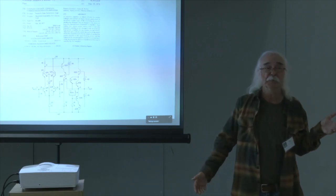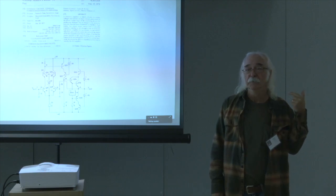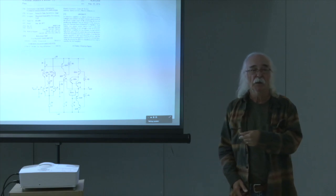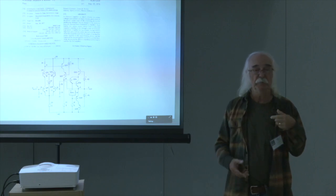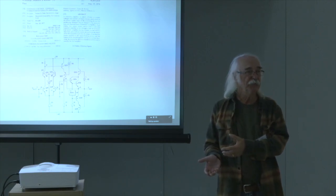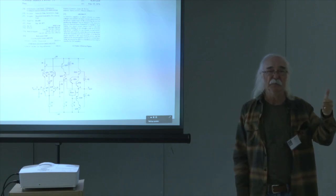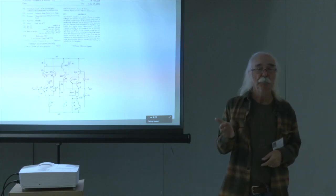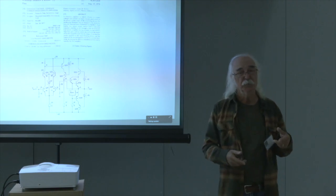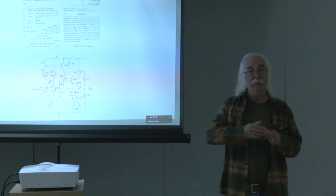There's another trick that is very common, goes back even farther. One of the reasons that a triode is so popular is that the variation of gain with respect to voltage and the variation of gain with respect to current are at odds with each other in normal operation. So at the point where a triode is conducting more current into a load, you will generally see that its voltage from cathode to anode is decreasing. The voltage decrease from cathode to anode is lowering the gain, but the output gain is going up because it's a function of current, and they're both logarithmic, and two of these square law functions will literally cancel mathematically. You can take two square law equations and render a no change situation.